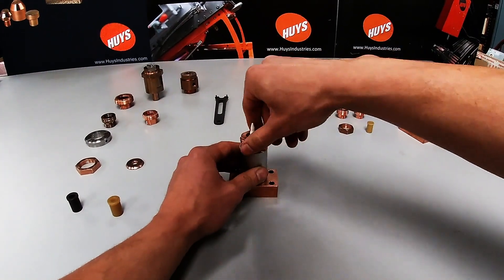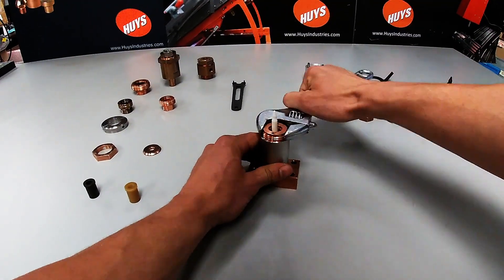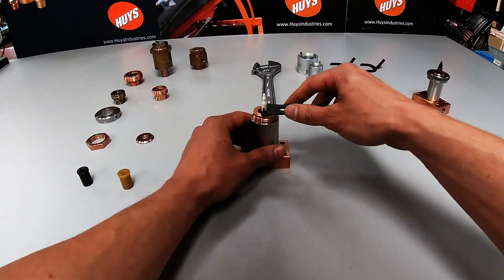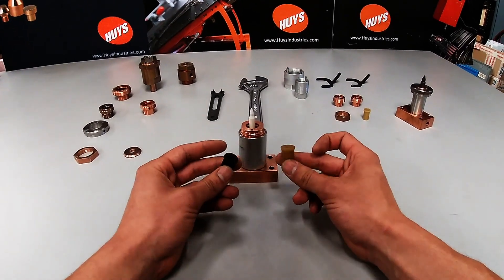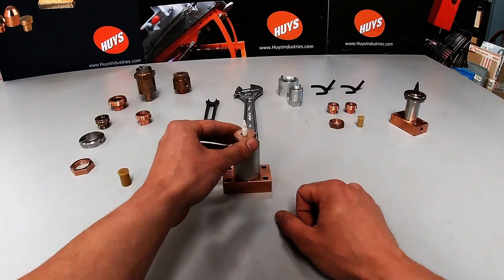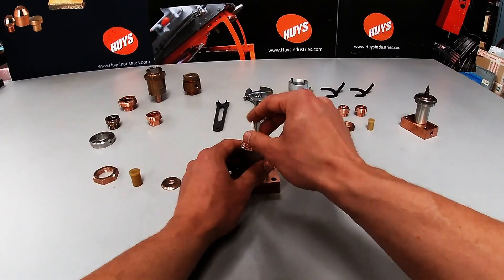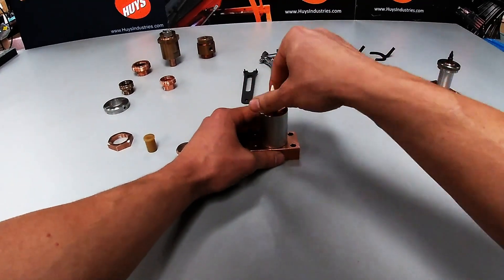Go ahead and thread it on. With the dowel pin base we have a couple of options: we can use a standard adjustable, a socket tool, or the dowel pin wrenches, which have both a 200 and 300 pin variation. Both allow you to keep the pin in place as you tighten it down. Then install either the ceramic or the plastic liner — let's try the ceramic liner — then the washer with the large OD down, and the same nut works here. That's it, ready to weld. Keep in mind the nut and the base are interchangeable between different pin sizes; the only thing that needs to be changed to match the pins are the liners and the washer.